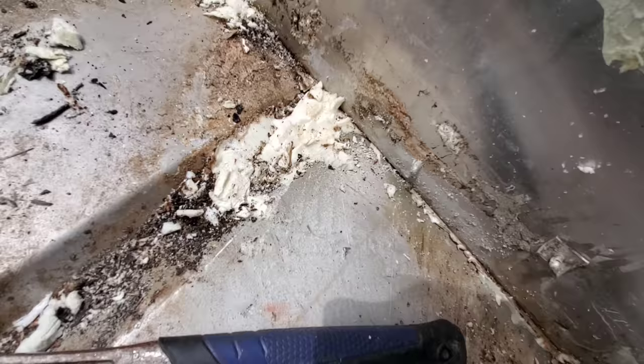All right, the aluminum I'm using is 1.5 by 1.5 inch angled aluminum, 1/16. You can get this on tinyboatnation.net. And I'm just using one of my old chop saws with a real crappy 40 tooth blade. That's what I'm cutting it with.